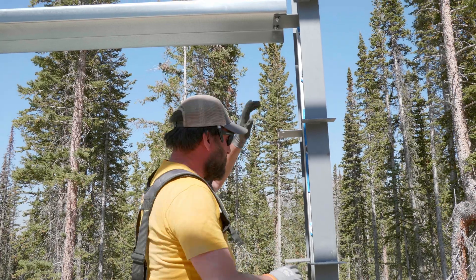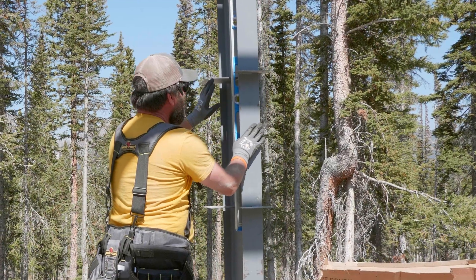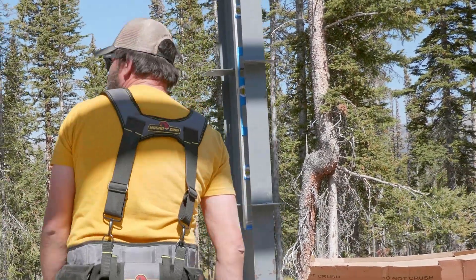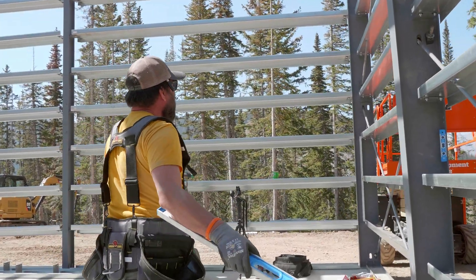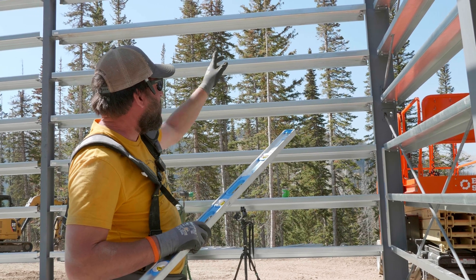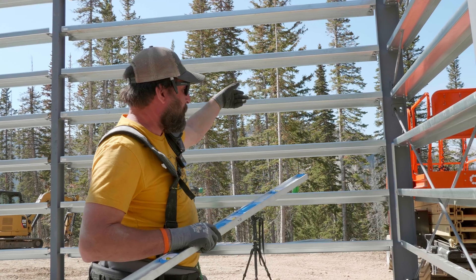Also, if we're checking plumb in and out of the building, we want to be on the outside flange, never on the inside — and this one is pretty darn close. On a wide flange beam — the two corner columns of this are wide flange beams, so those are mill beams — on a wide flange we can hold plumb off of the web. We're going to start tightening from the bottoms. I've set all the tops to where I want them, especially on the outside, because we don't want that bolt going through past the steel line where it'll interfere with panels.